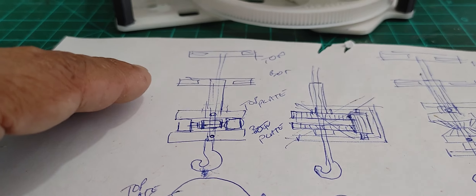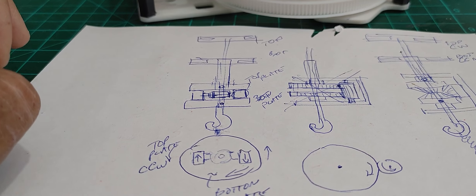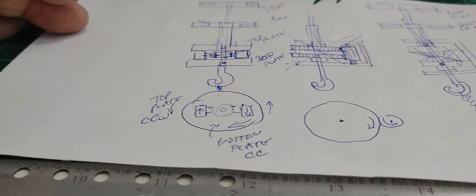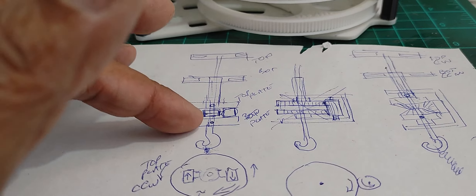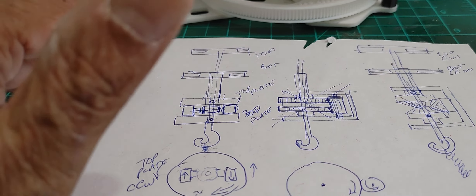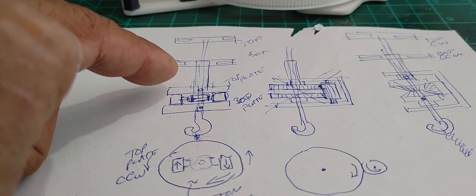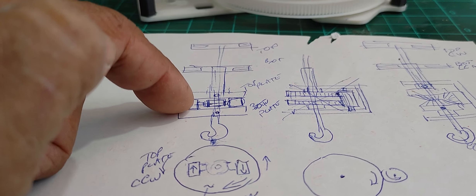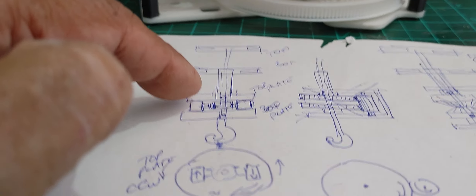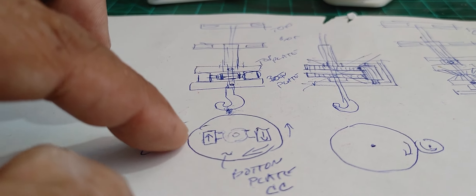Another way to do this — and by the way, I've done all these things back in the early 80s when I embarked on learning the mechanics of helicopters. I started with very simple mechanics, very simple contraptions, and went to more elaborate mechanics. I've done contraptions with pulleys, with thread, with bobbins, with gears, with plates, with links — just using pressure plates over rubber wheels. What I'm showing here is two plates, a top plate and a bottom plate, sandwiched in a compressed way over these rubber wheels. As the bottom plate spins, it allows the top plate to spin in the opposite direction via these wheels, by the way they're assembled.